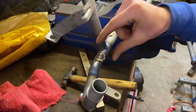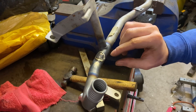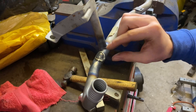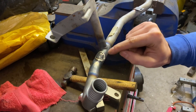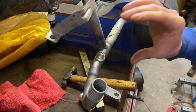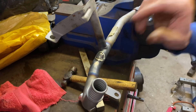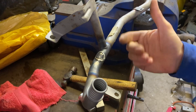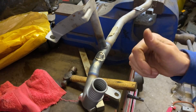Unfortunately that was a little bit messy because the little patch was sliding, and if I'd clamped it I probably wouldn't have been able to put the heat in where I needed to. As a result the flux has run and it looks a bit of a mess, but that's not a big problem because we could see the silver solder flowing underneath the patch - so we know we're going to have a good strong joint. We'll spend a bit of time cleaning that off, no big deal. We're confident that it's stuck and it won't leak - so that's your lot, happy days. Hopefully you've found that useful - a slightly different technique to traditional welding. Hope you've all enjoyed it and learned something - from Yorkshire Fab Shop, thanks for watching, see you next time.